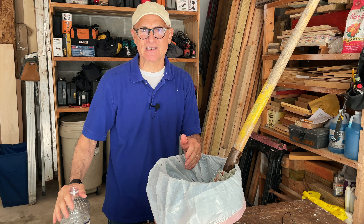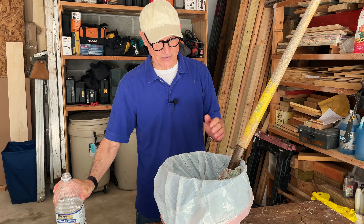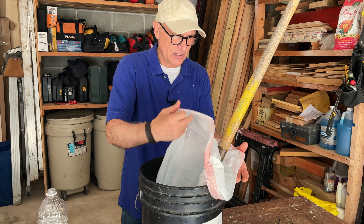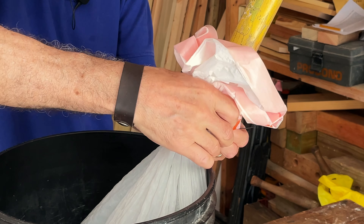It's only five percent acidic, but you'd be surprised — it's really pretty effective at cutting through rust. You could just fill the bucket with vinegar without using the towel, but imagine how much vinegar that would take — like two gallons. This way I use about a quart, less than a quart, so you can see it's much more economical. Once you get the towel soaked in vinegar, close the bag and put a twist tie around it just to hold in all that goodness.